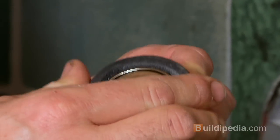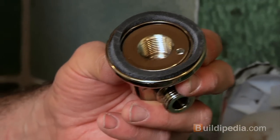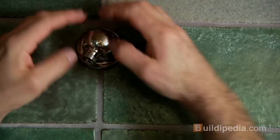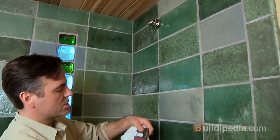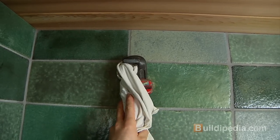This supply elbow has an o-ring inside and a escutcheon, and then this is a foam seal — it'll just thread on. I'm going to hand tighten it, and then when I get it to there, I can tighten it using a pipe wrench. And to protect our fixture, I'm going to use a rag between the pipe wrench and the fixture.